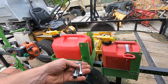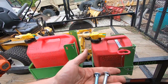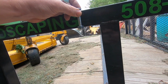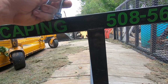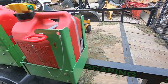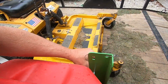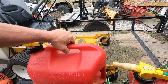But anyways, the purpose of this video is they come with these bolts that will not work. As you see, it won't go all the way through the 1.5-inch tube. So you can't drill through the top and the bottom and put a bolt on. So they also give you self-tapping screws, which, let me pull this one off, because this is the worst one.